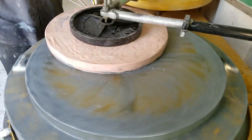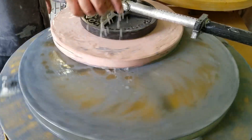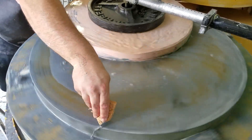The mirrors didn't come out of curve generating as spherical as we wanted, so it's going to take a day or two to get contact and we'll have to do a little muscling around to get the radius of curvature just right, but we're all right.